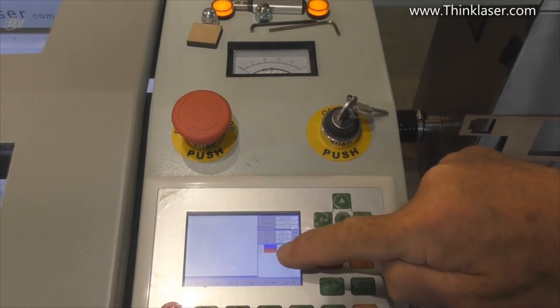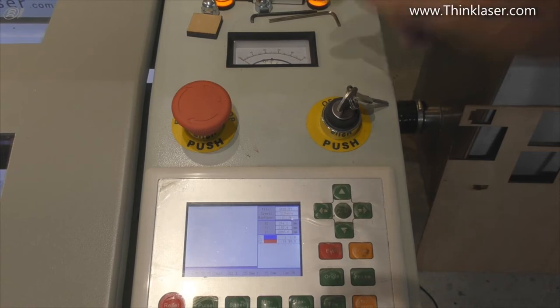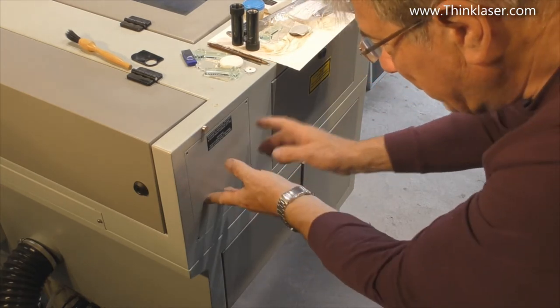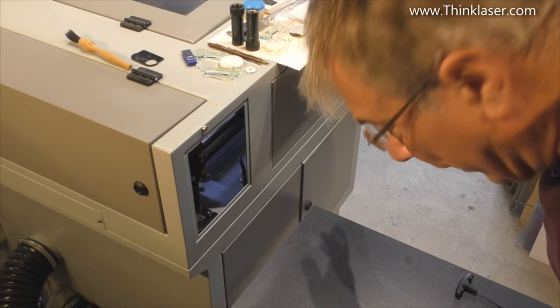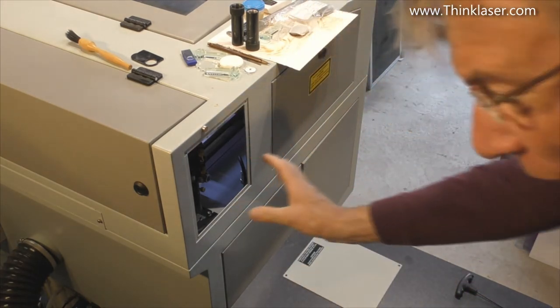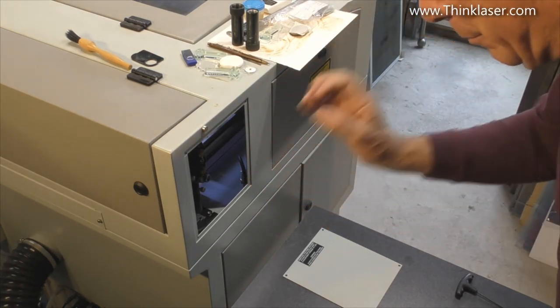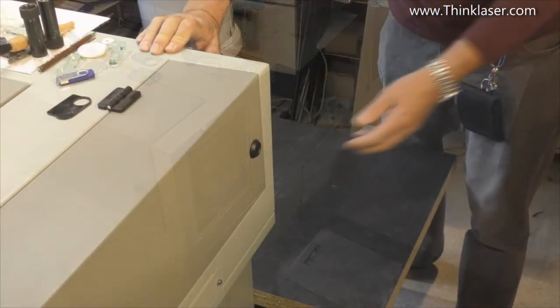Running this at 90% means I should probably be driving the milliamp meter more than the recommended maximum for the tube — I should be overdriving the tube. But don't let it worry you; for such a short period of time this is not going to damage your tube. There are warnings on all sorts of covers, so believe me it's just as dangerous to take this cover off and use the machine as it is to undo any of the other panels. You must at all stages be very very careful.